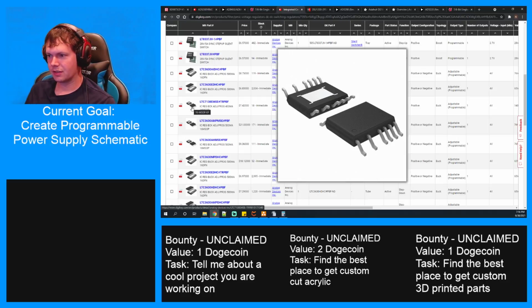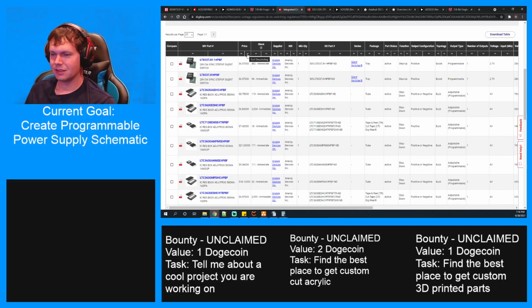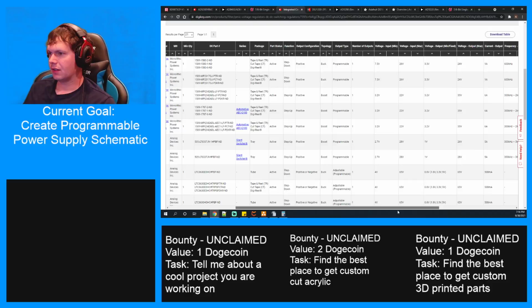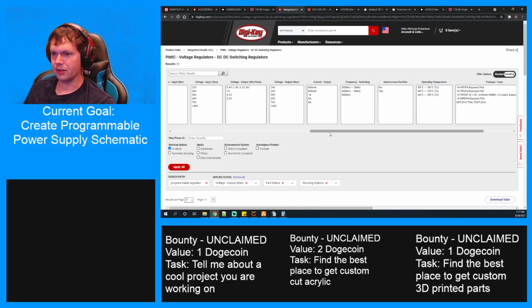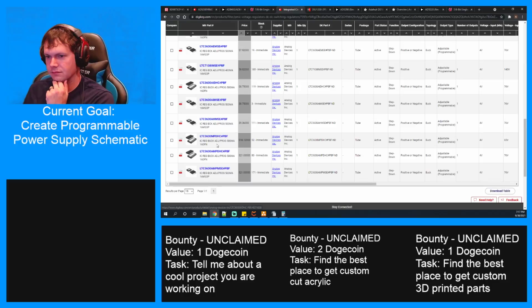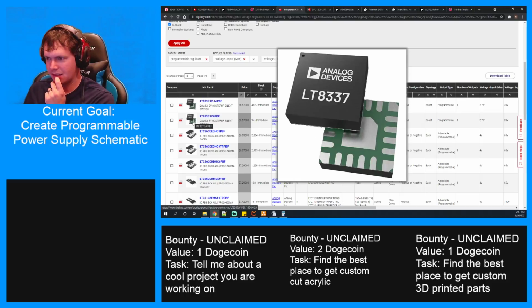Anything that I'm actually going to be able to use. Yeah, these are all heavy duty heat sink parts. They're all expensive too. I mean, we're getting rid of our potentiometer here, and maybe some components on the regulator. I don't know. We'll have to redo all of those. Input max 26. Oh, I need the input max to be 28 or higher with our current setup. Yeah, so not doing ourselves any favors there.